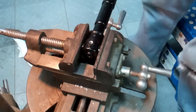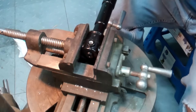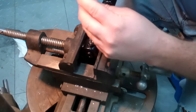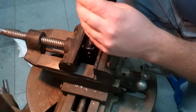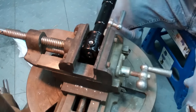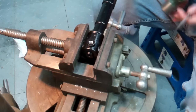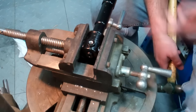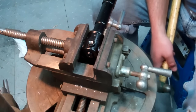The last thing you've got to do is bust off that little tang in there, and then the threads will be permanently secured. That's all you've got to do to replace some damaged threads in a fixture or something that has been stripped out. Some people might use a little bit of Loctite, and that's okay — just let that dry before you put the bolt in. This works on motorcycles, cars, just about anything. Hope you learned a little something — it's easy to do and pretty inexpensive.